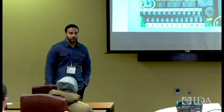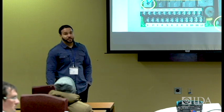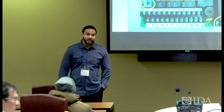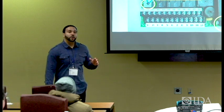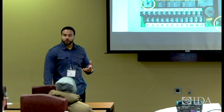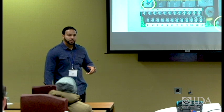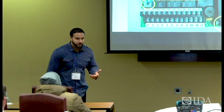Where is the unit set up at? What's the application? What do they need to do? In the hospital, they don't need it to be closing off areas. They need to be getting up out of there. So it will contain a fire. But if you have nuisance drops because you're not servicing it properly, you're going to have these type of issues. So don't pop the piezoid. Don't never let nobody talk you into popping the piezoid.